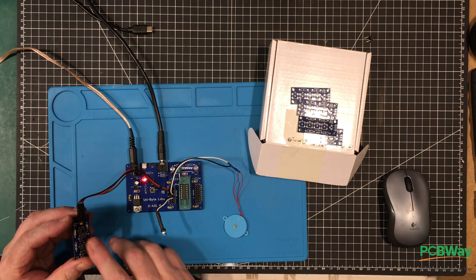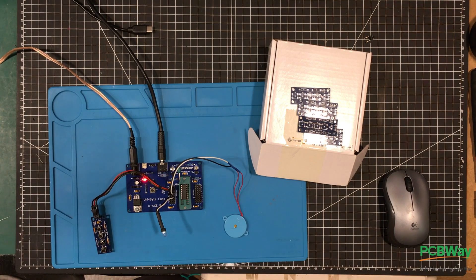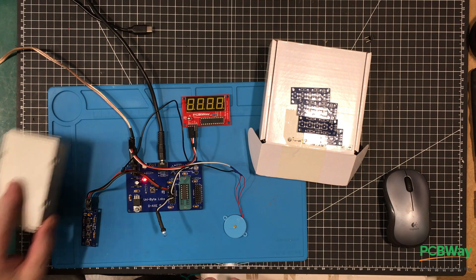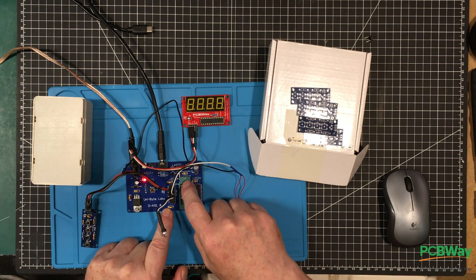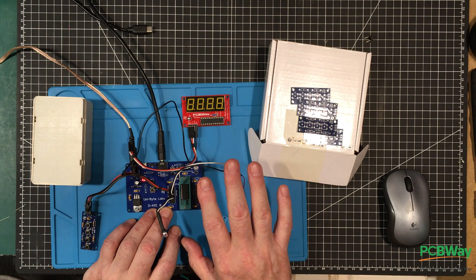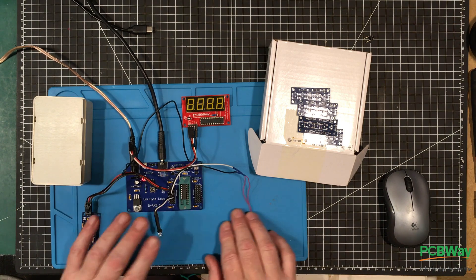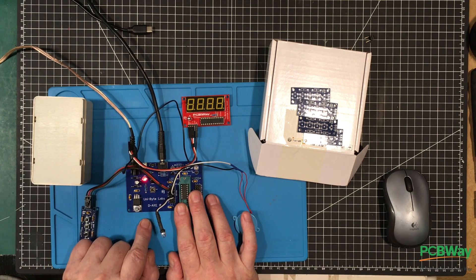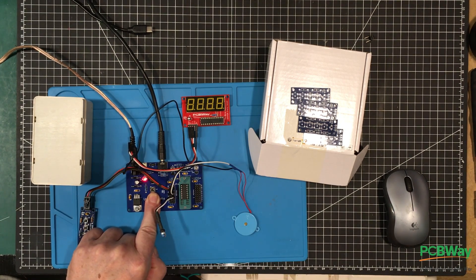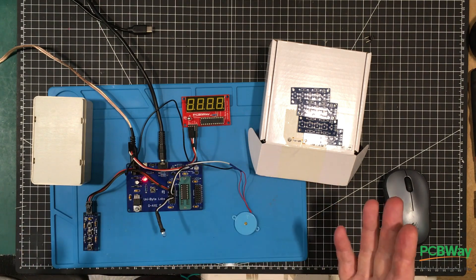It works — another successful project. Thanks again to the guys at PCBWay for helping out with this, I really appreciate it, it makes it all possible. Next time we come back to the modular design series, we're going to design using basically these pieces — maybe a couple of other things — and design our board to fit into this box. I originally wanted to use an 08M2 PICAXE for the compact size since I only need six pins, but the unfortunate thing is it only has four output pins, one of which is also the analog-to-digital conversion pin, and the two other pins are input only. So I was unable to get enough pins and I'm going to use the next best one, the 14M2. Thanks a lot for coming out, and I hope to see you back for the next one where I design the circuit and we send it off, get a PCB board, and build it too.